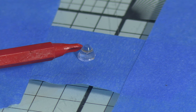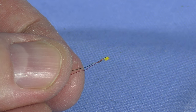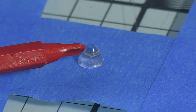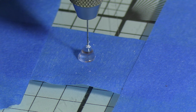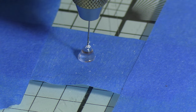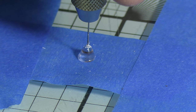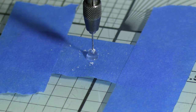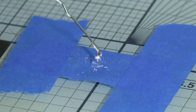The next step is to drill the back of the lens for an LED. I'll be using a 603-sized warm white surface mount LED with my own leads attached. I deliberately left a flat spot in the center on the back of the lens. I'll start by drilling a pilot hole with a number 78 drill bit, taking care to keep the drill bit centered. I'm only drilling part way into the lens — just deep enough for the 603 LED. I'll follow with progressively larger drill bits to expand the hole, finishing with a number 54 drill bit. Then I'll put a tiny drop of canopy glue into the hole and attach the LED.